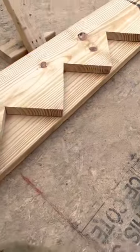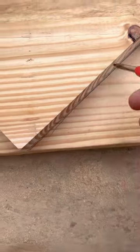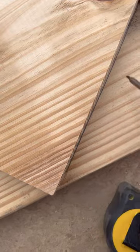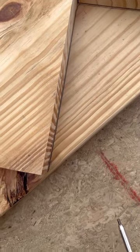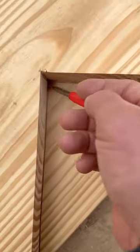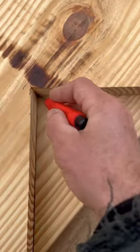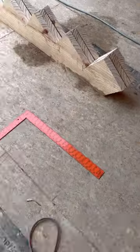Okay, now I'm going to mark this out. You'll see how you gain just a little bit the thickness of the lead. You can sharpen your lead very sharp and eliminate some of that, but my point for mentioning it is that when I make my cut, I'm going to make sure I take all of the visible line. I'm not going to leave any line showing. That way I can try to make sure this doesn't grow at all from copy to copy. I'm just going to mark this out 2 times, all using the same pattern. Let's do it.